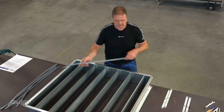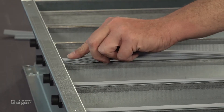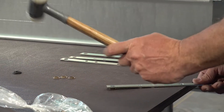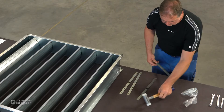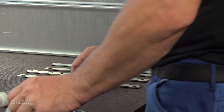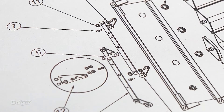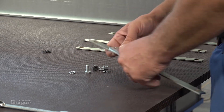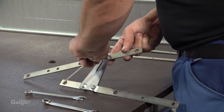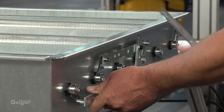Next, the rubber edge seals are placed in the slots of the blade profiles. For preparing the rod sections, please insert the sleeve bearing bushings. The connector set is fixed with two rod sections. A look at the assembly chart might be helpful to understand the design. After this, the rod sections have to be put on the rod levers and secured with retaining rings.